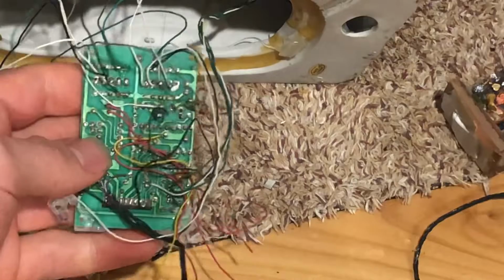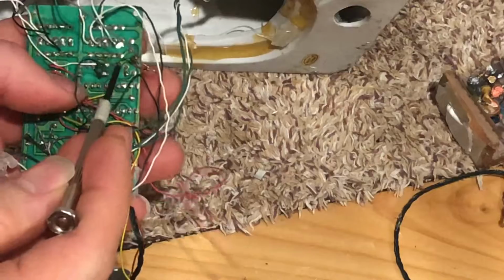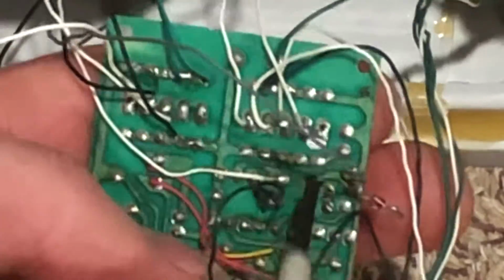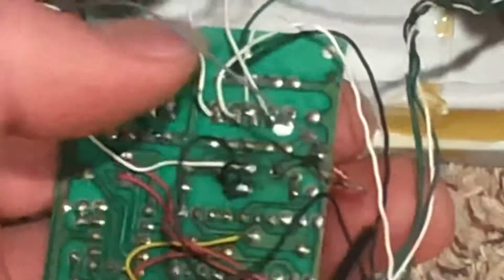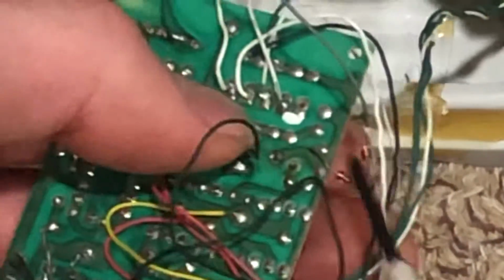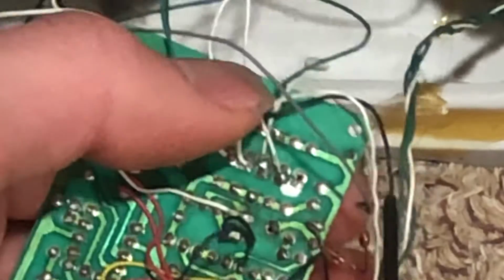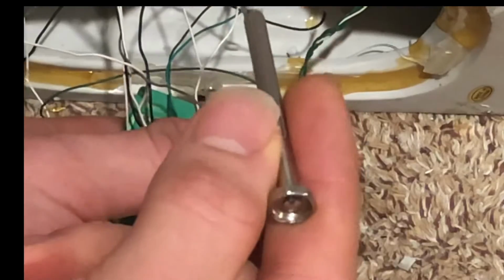So if you look at this, here on the computer board, you can clearly see these holes are not fully filled, and that's evidence of tampering. Here's again. And then a lot of the wires got ripped off. And then right here, you can see this is a floating joint. They have this weird twisted thing with 2 diodes. Diodes basically will allow power one way but not back. And this is connected to the power lead for the motor on the top of the building.